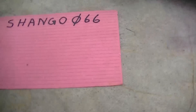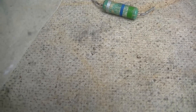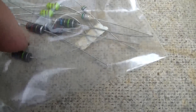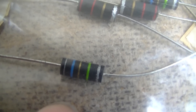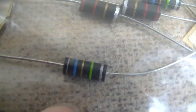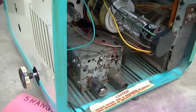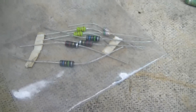I went to my local electronics store today and came home with these. Looking at this one: green, blue, silver. This little tiny one is also green, blue, silver — that is a 0.56. And this one here, which looks like gray, blue, gold, green, silver — that is a 5.6. We also had a 2.2 in there, so I grabbed a 2.2 and a 0.22. I'm not quite sure how to read these; this is something new to me.